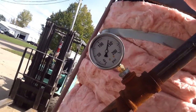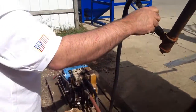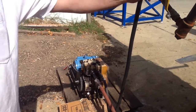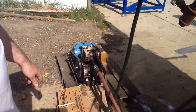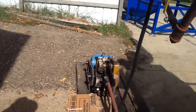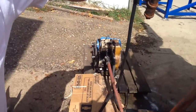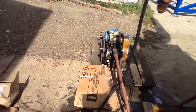We're going to go ahead and kick on our motor. Right now this is just being run by steam and it's not grid-tied, so the motor is running much faster than it should be. We've got a good gear ratio there. When we grid-tie this, all we do is plug it in, and you'll hear the motor slow down because it's now pushing the generator.